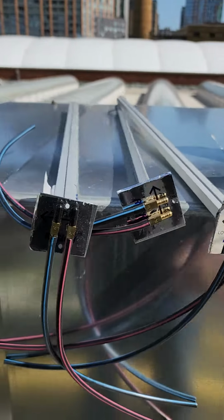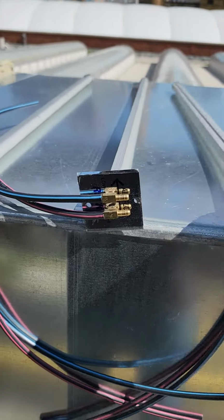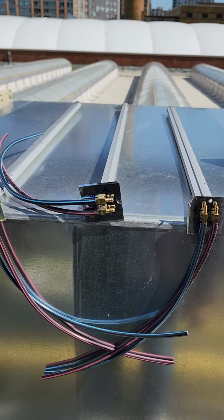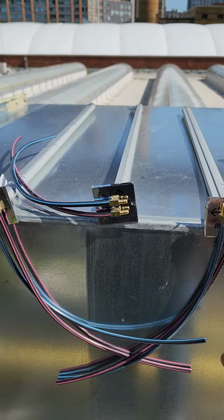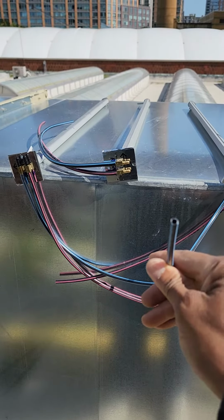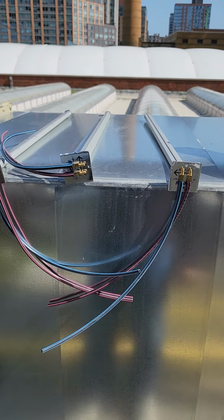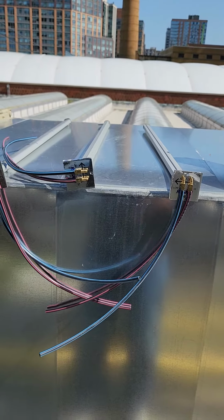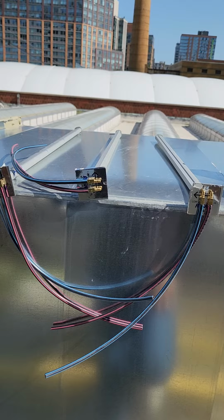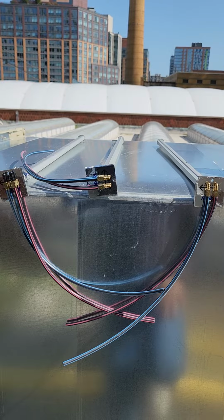Type of airflow measuring station. They go straight through from one end of the ductwork to the other, and these we use to monitor the flow. As the air passes through, we monitor the air, and we're able to detect how much air, via calculation, is going through the ductwork, and we can set things like how much air should be in the building. We can monitor and measure things a lot better, how much to put out, how much to put in, and it's just a much better way to work.